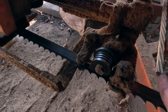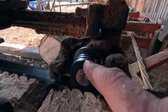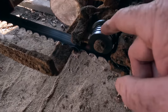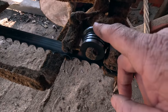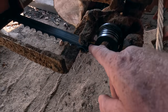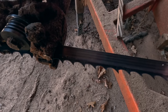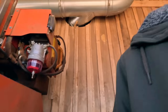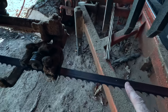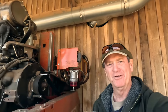That pitch buildup is going to go between the band and the roller, and it's going to cause that band not to roll or ride correctly on the roller. Why would you pay somebody to precision-grind these rollers and make them out of hardened metal so they drive your saw blade perfectly, if you've got a big bunch of crud glued on right there? It's not going to work. Your goal is clean bands and clean rollers — that's number two.